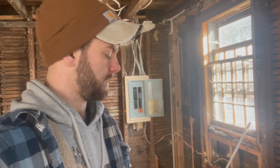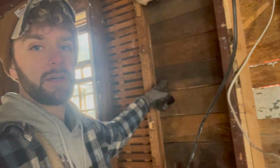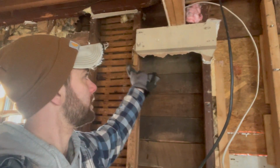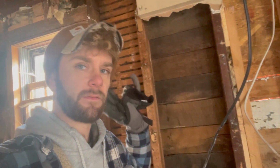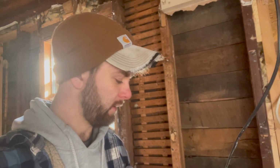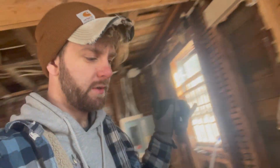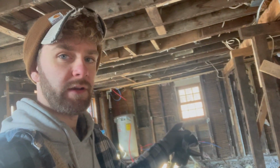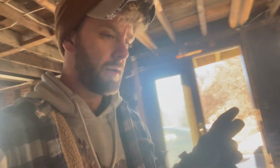And then I'm going to install a stud pack that'll go from the base up, catches whatever it can catch, leave what's there for now, maybe even put another stud on this side and use what's there. Drill, put some big lags in so that there's like triple the security on this end for now. That'll take care of this side of the beam, the middle. The other side I'm fairly confident with right now. So I gotta get those things in place before we pour concrete.